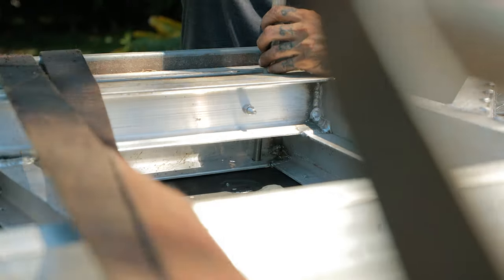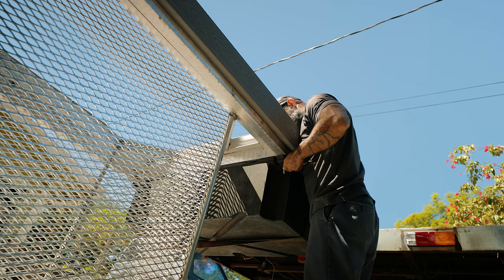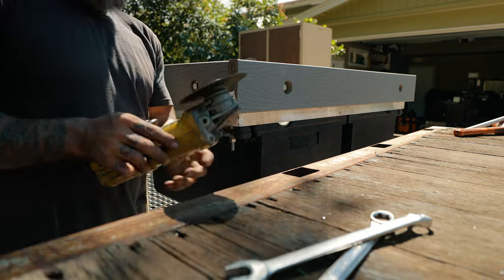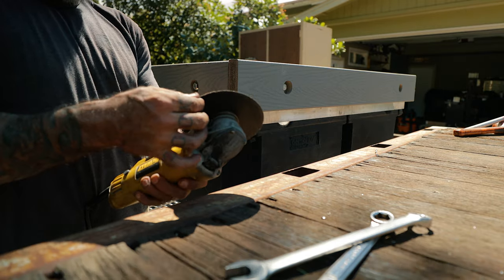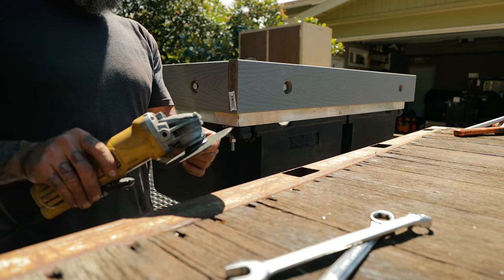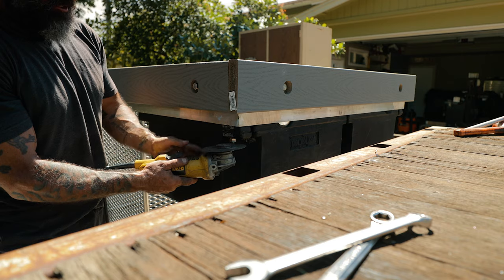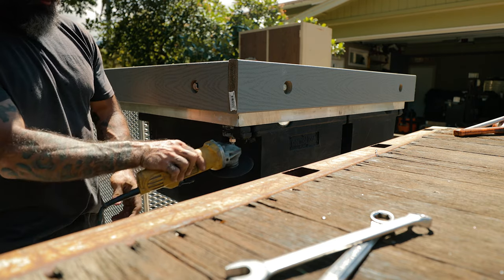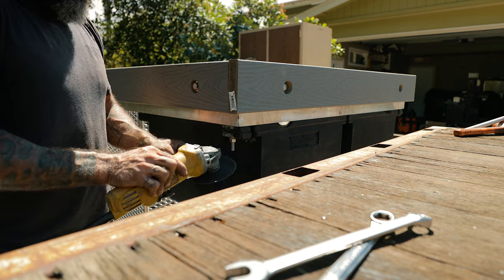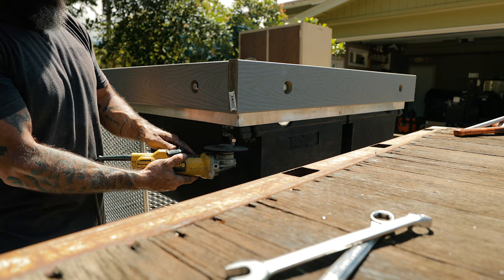Grab a tapper. So this is the cutoff wheel I use. I just try to find the thinnest ones that I can find. It's just an abrasive cutoff. You can put a 5-inch on a 4.5-inch grinder, and you just be careful. Like, I only use this much from about here to here. I see people cutting like this all the time, and that'll make the thing come back at you. And I've seen guys actually injure themselves like that, so I prefer to cut it like this, and you have way more control